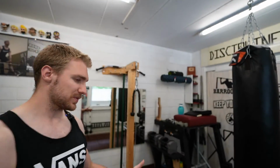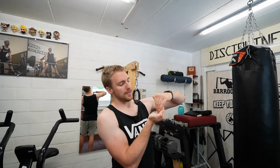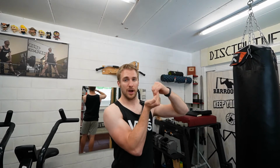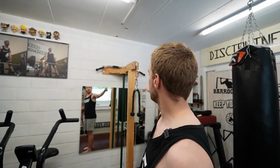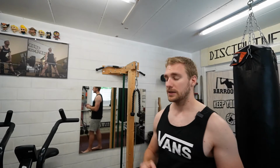The way that we finally hung up 2 mirrors, and especially this big one here, was with a French cleat system. So a French cleat system is basically a hook that you hang like this on the wall, and then you hang another hook onto your mirror, and then you can hang these ones together, and then you have like a solid system. The benefit of that is that you can always remove your mirror safely, and you can potentially hang it up anywhere else. Mind you, this is a mirror of 1.20 meters by 1 meter, and I could hang that up by myself. So that's very easy.